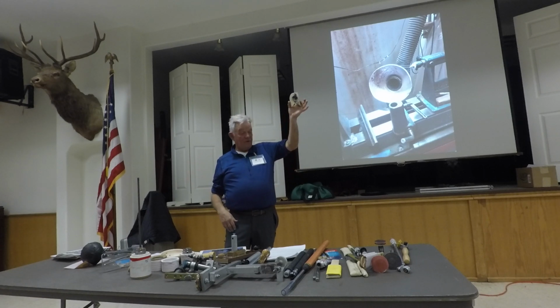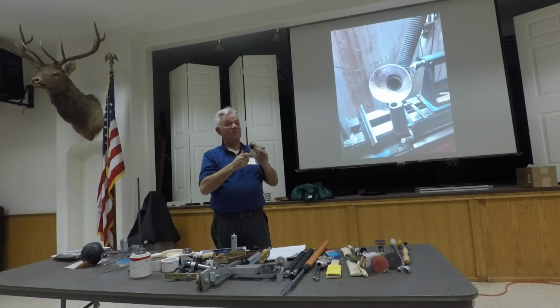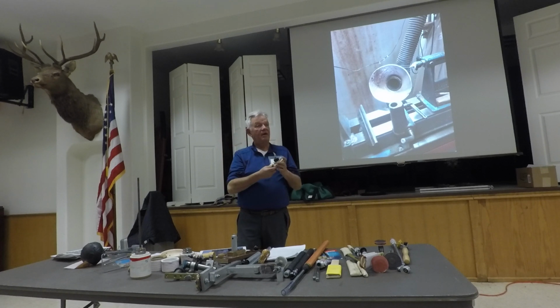And the first thing I put on my little list here was mag switches. Are you familiar with mag switches? They're just cool items. You turn the magnet on, you turn it off. I have 2 of these on a little 45 sled that I can set on my bandsaw. And this holds that sled well enough that if I'm doing a lot of spindle work, and I've got squares, I can knock off all those edges real quick and easy.